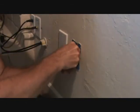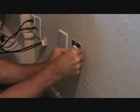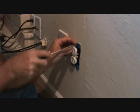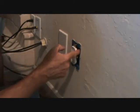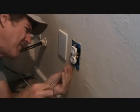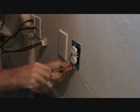I want those wires in there like that. I know that's going to be good. If it's crooked, I can take this and kind of bend it to the left or the right, whatever, before I get the screws situated. That looks pretty good. Now I can just put these screws in here, knowing that I can suck this all the way up. If there's a wire back there keeping this from pushing in, I'm never going to know that until it happens — then I'll strip it and it won't hold. Not a good idea to do that. I'll just tighten this up now.